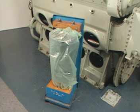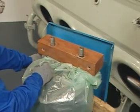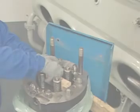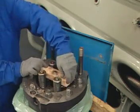All required gaskets, seals and hardware are included in the shipping container. Remove the nuts and bolts from the wooden block that secures the assembly to the container. Also remove the bolt and wooden block holding the piston, and set both blocks, bolts and nuts aside for reuse.